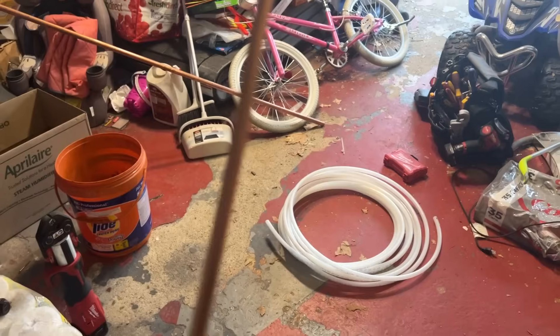Here's the final product. We need a switch plate on there, but we're good. It's going to take up to 24 hours before this thing really humidifies the house, but nonetheless, we got lucky here — we had a drain there, so we just cut in a trap and a standpipe for the drain, and we're good.